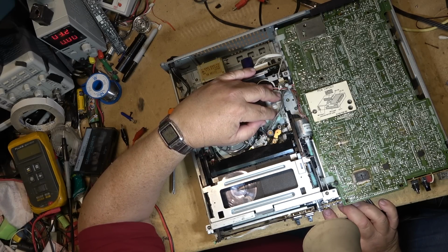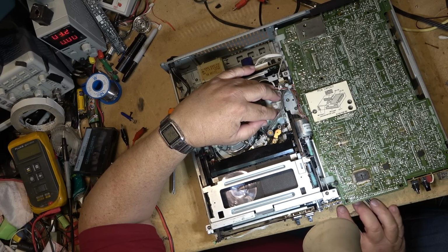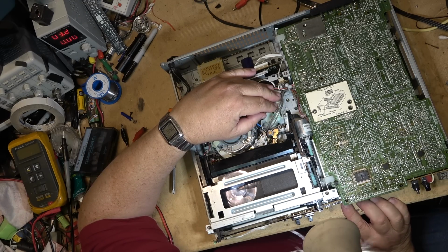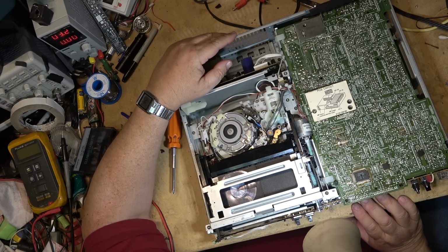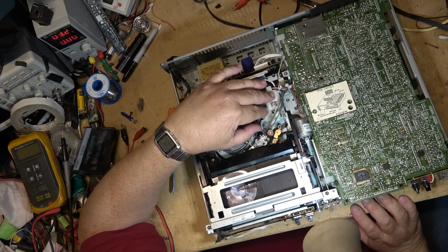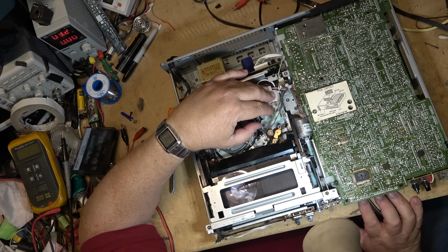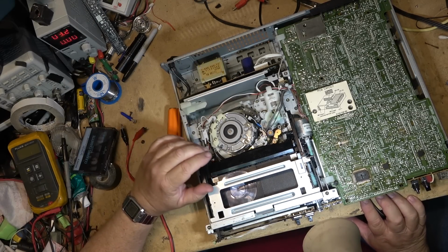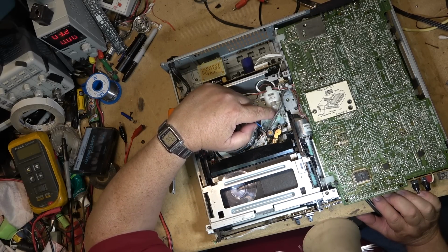It might be the motor. Now going from fast forward to stop. Notice it has a conventional linear power supply. Sony learned their lesson on the 2500 and 2700 with their switching power supply and went back to a linear one. It's doing it again.